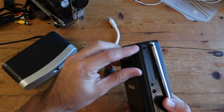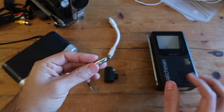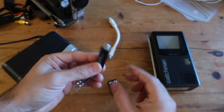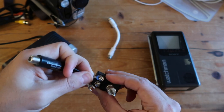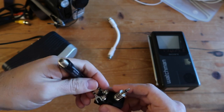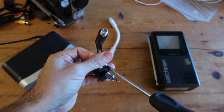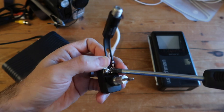Now that you have all the items you need, I'm going to show you how to connect everything to the external antenna port of your Sony Watchman. Grab your 3.5mm adapter and plug it into the antenna matching transformer — it just plugs in like that. Then use your UHF-VHF matching transformer, placing its small arms into the inner connectors of the matching transformer. Use a screwdriver to make sure the connectors are secured in place.